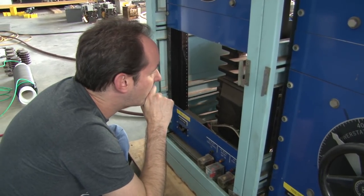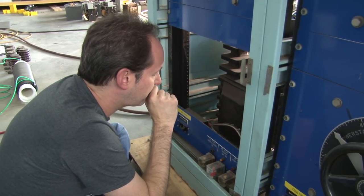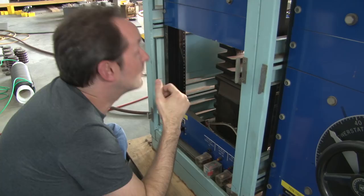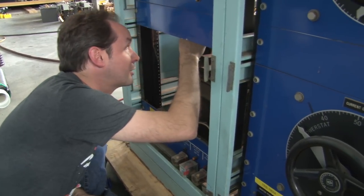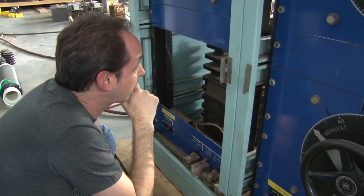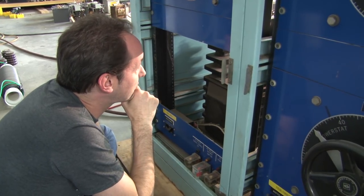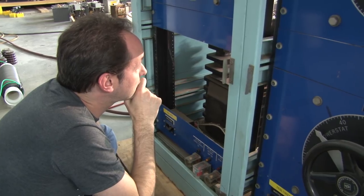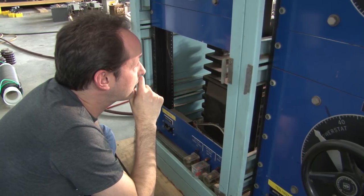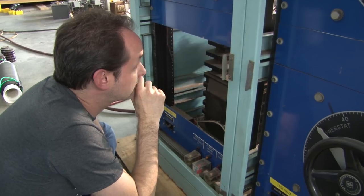So, Paul, I'm having a thought and I want you to tell me what you think. This is a 1500 VA transformer, 1.5 kVA. That'll do 30 amps quite happily all day long. Our current limiting is going to take us to 20 amps. What if I remove that and upgrade us to a 10 kVA pig sitting in here? Got something that'll fit? I think I do. Go shopping. That's more than just changing the current limiting. That's a dramatic upgrade of this cabinet. Yeah. All right, I'm doing it.